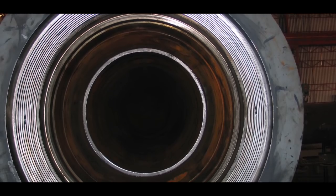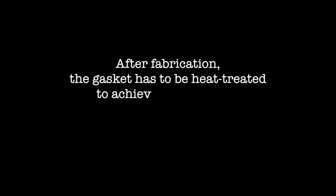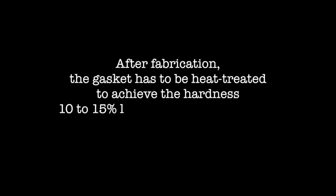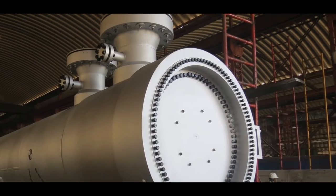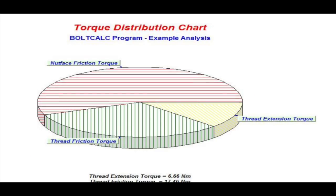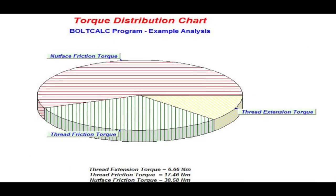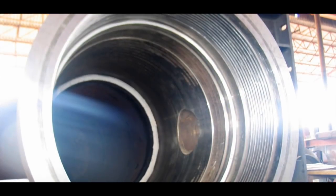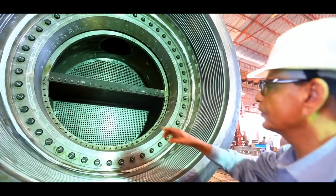To ensure this, first, the hardness of the gasket face after stress relieving and machining must be checked throughout the gasket face. Second, after fabrication, the gasket has to be heat treated to achieve a hardness 10% to 15% lower than the gasket face it is tailored for. Third, tightening procedures should be such as to apply load uniformly distributed throughout the gasket.